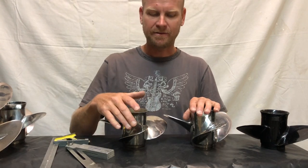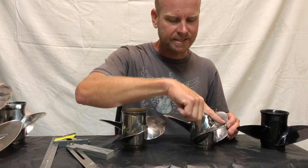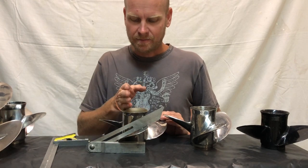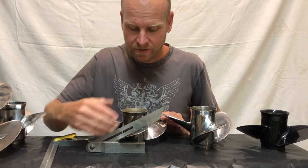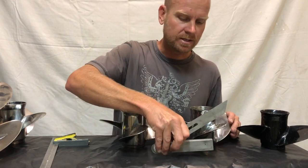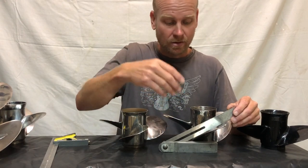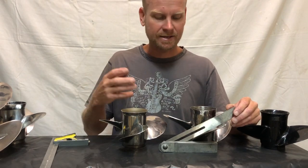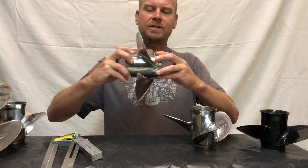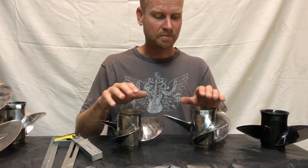As we saw, these two propellers here have a very different rake angle — it's the way that the blades are connected to the hub. But the way a propeller pitch is measured is on these blade faces here. If we grab a bevel — it's a rough way to show you — it's reasonably square off that blade in the centre of the blade, touching the leading edge and the trailing edge of this low rake propeller. If we do the same thing on this high rake propeller in the centre of the blade, also square to that blade and touching the trailing edge and the leading edge, you can see how they've said that these are both 11 pitch. That means they will travel 11 inches each turn through the water without any resistance. But these propellers I can guarantee will behave very very differently in the water.